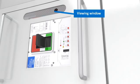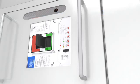An indicator lets you know whether the breaker is connected or disconnected. Note that safety features are designed to prevent personnel from connecting or removing the breaker while it's on and energized. The racking port allows access to the racking mechanism to draw out the breaker. To rack the breaker, turn the crank clockwise until the indicator shown through the window is red.